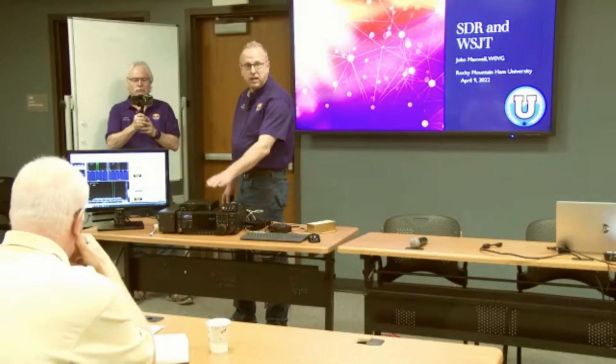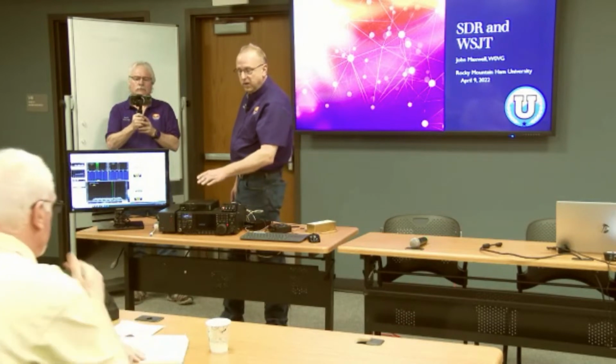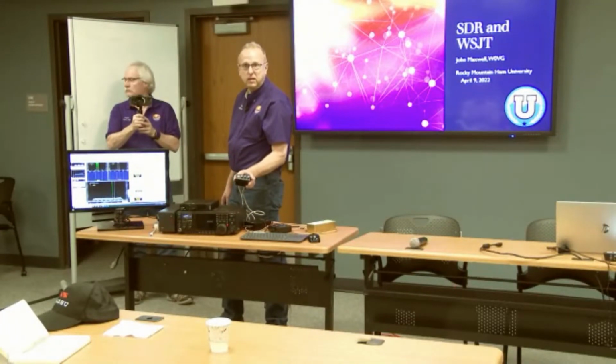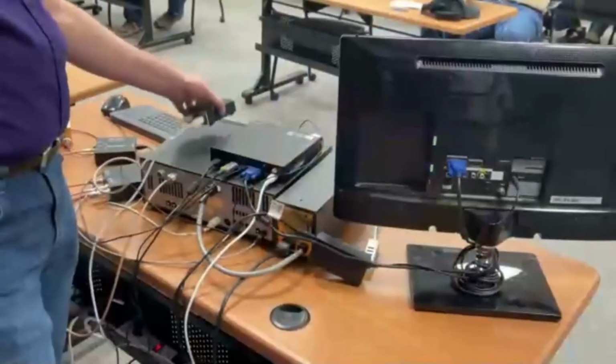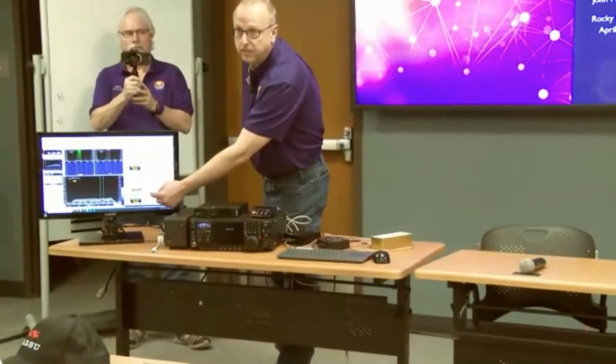We're going to take an SDR console, which is connected to the SDR play, and we're going to take that into a computer through a sound card. And this is basically the same thing that you would have for a SignalLink USB, except this one's made by Masters Communications, into the computer. And then the computer, depending on which mode you're going to run, we're going to do FT8 or MSK, meteor scatter. I'm only going to do two here in this example, but you can do as many as you want. In the summer, when the bands get to hopping, I do as many as 7 at one time.